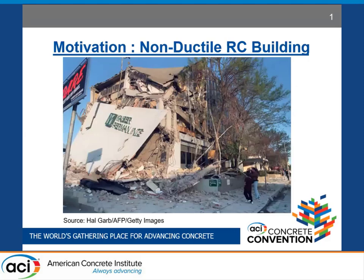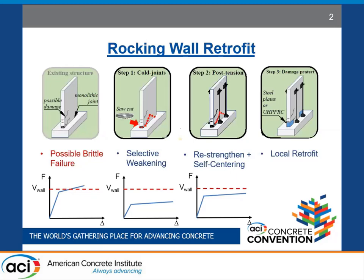The primary motivation of our overall project is to provide a suitable retrofit solution for non-ductile RC buildings. These buildings are in the thousands and are spread across seismically active areas across the United States. They are prone to brittle failure and possess significant seismic hazard. Many of these buildings have reinforced concrete shear walls as part of their lateral force-resisting systems, and these walls are subjected to possible shear failure due to improper shear reinforcement and confining details.